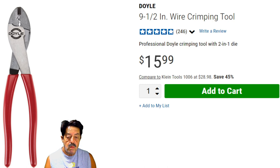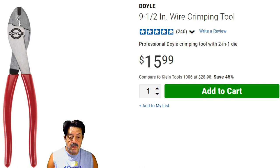Now, I'm going to give you a tip. When you're out there buying these, I went out with a friend of mine and he picked up a pair, and I said, well, hang on. Because I did this with calipers that I bought from there. Open and close them and make sure that those jaws are lining up perfectly, those sharp edges. If they're not, put them back and grab another pair, because some of these are kind of tweaked. That doesn't make them junk really. You just have to be careful in your selection. Otherwise, you'll get out of there and think you crimped down too hard on something and bent that part of it, which isn't the case. You just bought them that way. So make sure you spend the time and play around with them. That's one good tip for you to think about when you're there.